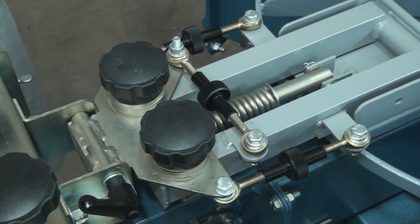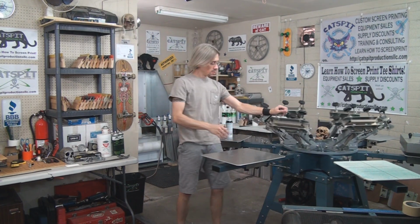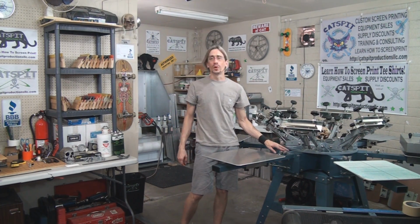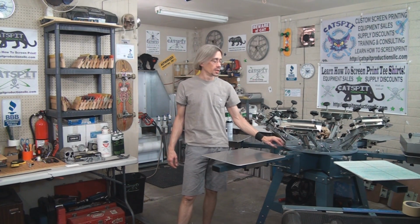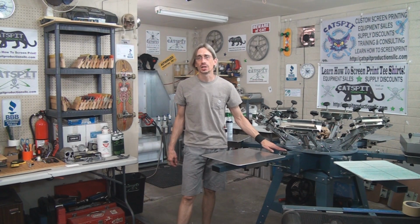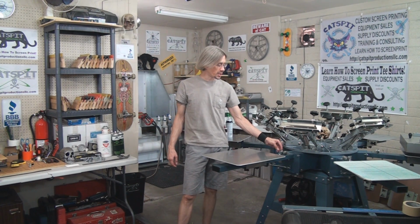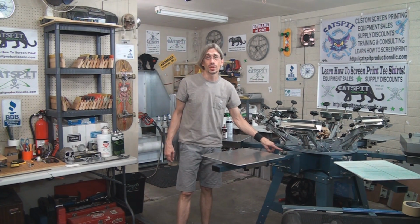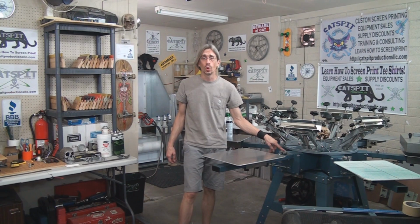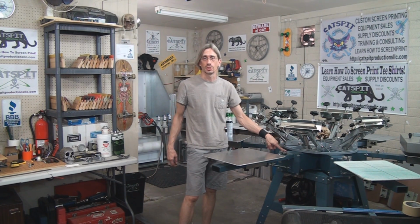So that's it. One other thing you want to maybe perhaps lubricate are your steel roller wheels, if you have such, or any kind of rolling wheels here. You just want to make sure, because they're going to get a lot of spray tack, that these are cleaned well and then lubricated however you can. But because of the position it's in, be very careful that you don't leave too much oil or residue that when the shirt's loaded, it'll get on the shirt.